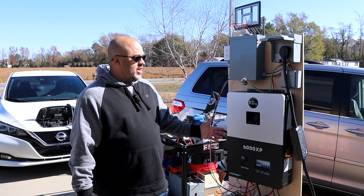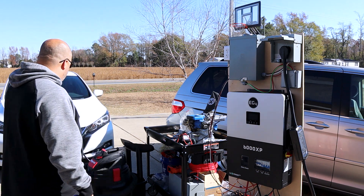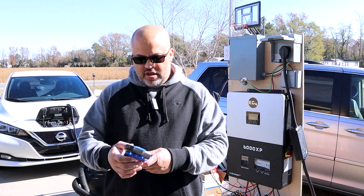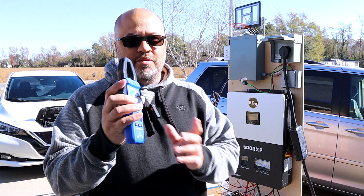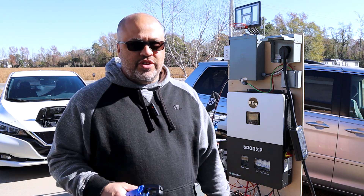It's not going to be a perfect test. I just have a few different things I'm going to try. I have a saw and a shop vac. I'm going to use a meter, put it on there on max amps, and we're going to see what the surge is.